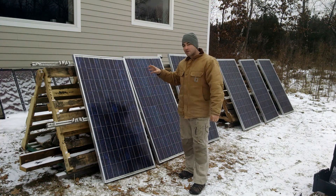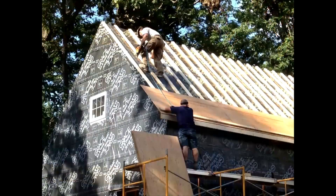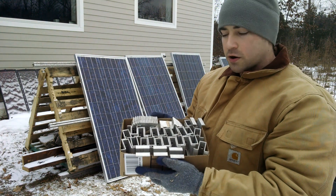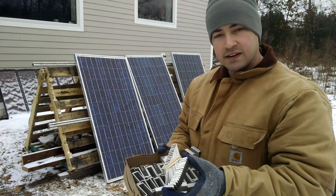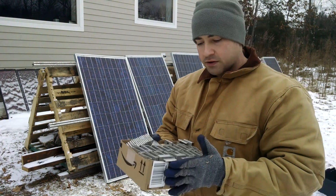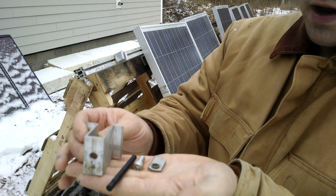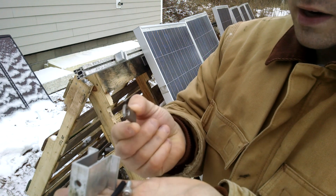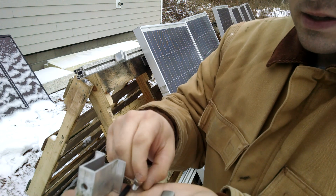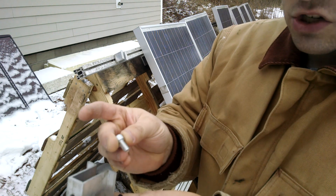As you can see, I'm going to be installing some photovoltaic solar electric panels in this project. I have a box of hardware — these are mid-clamps and end-clamps. So we're going to mark these out and install a couple. This is a mid-clamp. This is a stainless steel nut that's made for T-slots. This is a socket head bolt, and it's 5 eighths of an inch long.